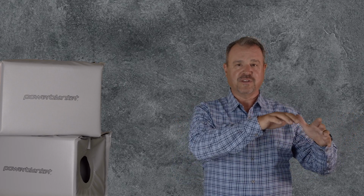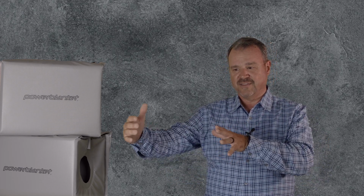In 25 years, I've seen a lot of funny things. Electric heaters don't like water. One example is, I had a customer who had a lot of very large 365 kilowatt circulation heaters vertically installed, so the terminal box was on top. While these units were being stored in the yard, they left them in the open air and the terminal boxes were taken off and they filled with water as rainstorms came through the winter. When springtime came and they decided to install these in the process, they rolled the terminal box over and bolted them shut. So when commissioning time came, they didn't work.